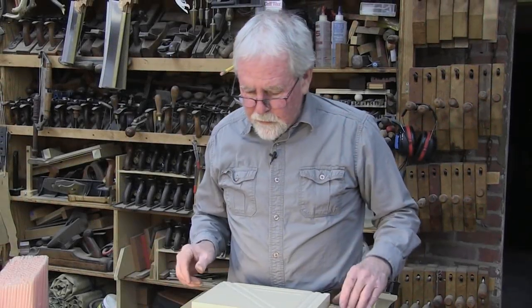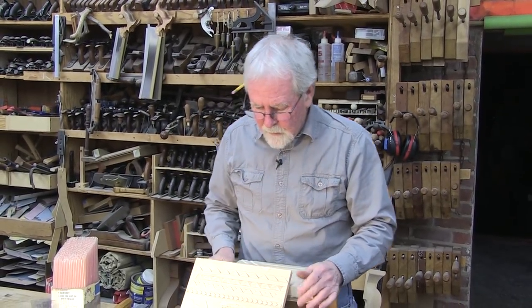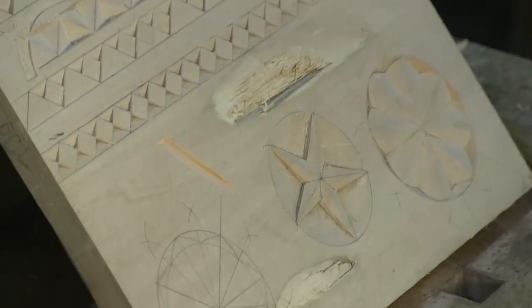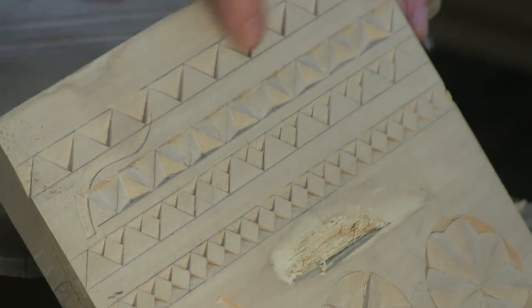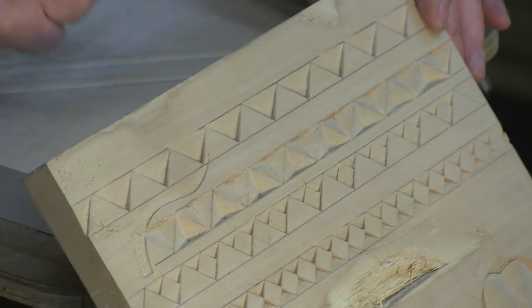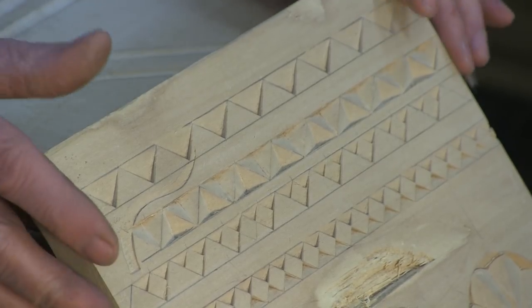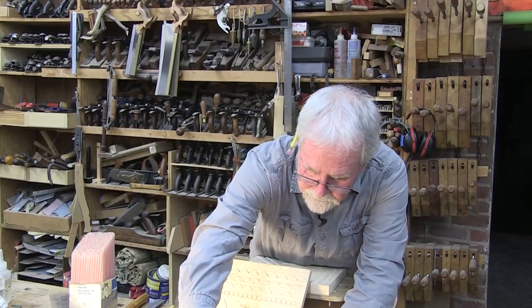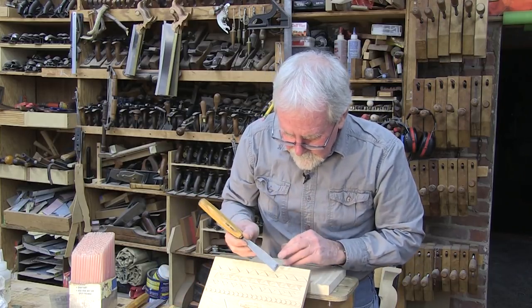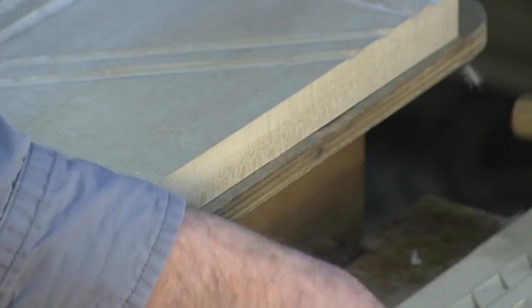I'd like to show you a little bit about chip carving. On the opposite side of this board you can see some decoration going on, very similar to that little box I showed you earlier. This is what they call a sawtooth — one of the simpler ones to do. The sawtooth requires a different tool: a straight chisel that's wider than the actual cut you need to make, and we need to do a layout first.